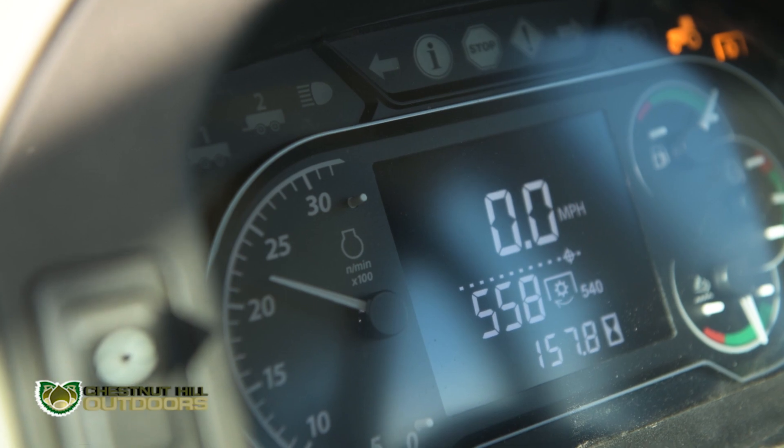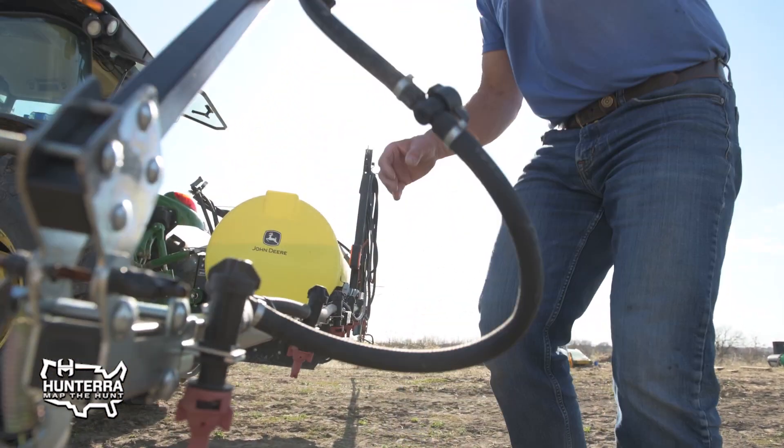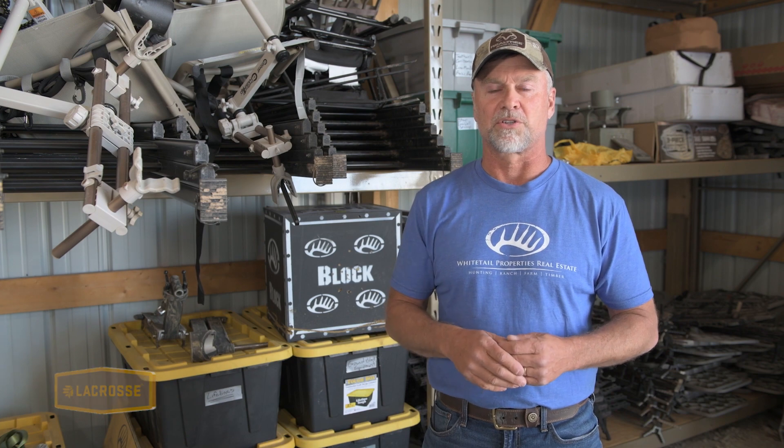If the output is either too low or too high, there are three methods to bring it back into sync. The first and easiest is to change the pressure on your regulator — tested at running RPM, in this example 2200 RPM. If you're set at 35 psi, simply turn the knob down to 25 or 20 and redo the test. The second method is to increase or decrease tractor travel speed; if the rate is too high, travel at five miles per hour and test again. The third method — the most cumbersome — is to change the nozzles to put out more or less volume. Most sprayers are already set up for the average range, so it's highly unlikely you'll need that third step. The first two are much easier.